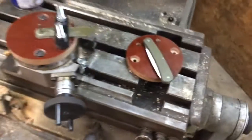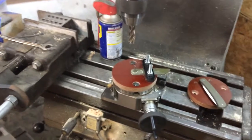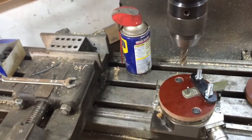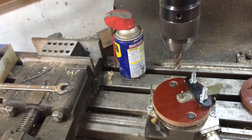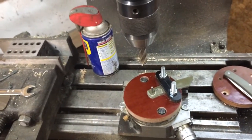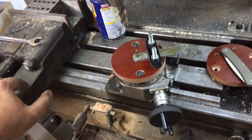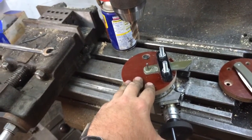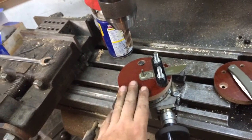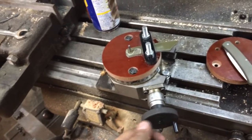So that's it. I know there are different ways of doing that. I know a lot of makers just simply use a clamping block that sits over a pivot in their vise and just run it around by hand — and that's perfectly acceptable and works just as well. But I got this idea actually from another knife maker whose name unfortunately escapes me. He had a tutorial posted on his website that showed him using a rotary table, clamped directly to the table itself, pretty much the same idea — he clamped that down and used it to mill his liners.